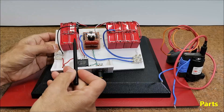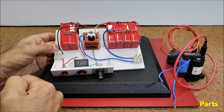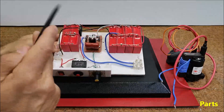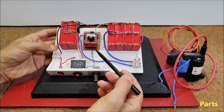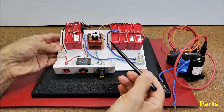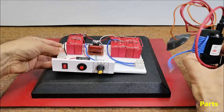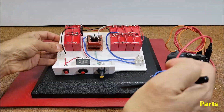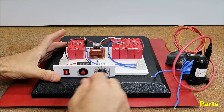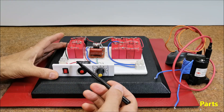The device consists of several components: two MKP capacitors with a value of four to eight microfarads, 400 volts — for example I use four parallel connected capacitors of one microfarad each for four microfarads total. Next, one capacitor of 100 nanofarads 400 volts, a diode bridge, two 1N4007 diodes, a 500 kilohm potentiometer, three SCRs of the BT151 type or similar, a flyback transformer from an old TV or CRT monitor, and a few resistors. I also put an automatic fuse at the input of the circuit, which should turn off power in the event of a circuit error or burnout of any component.